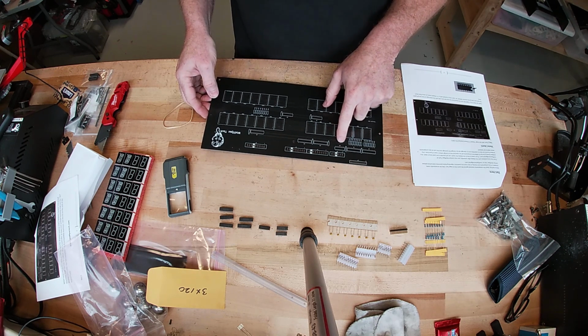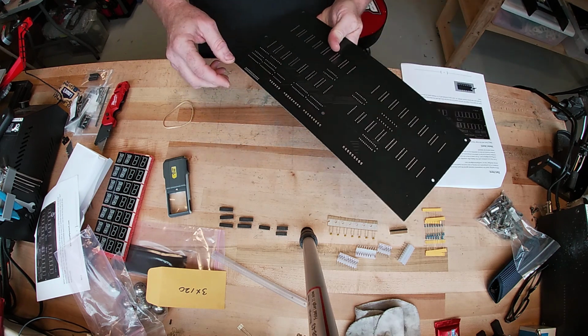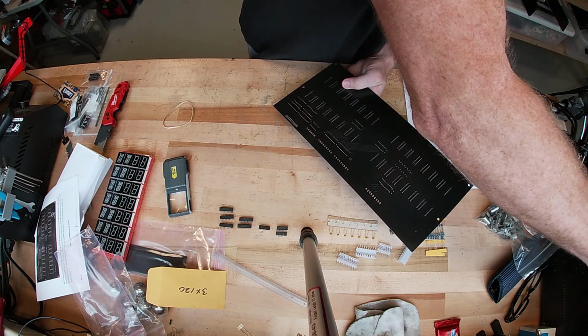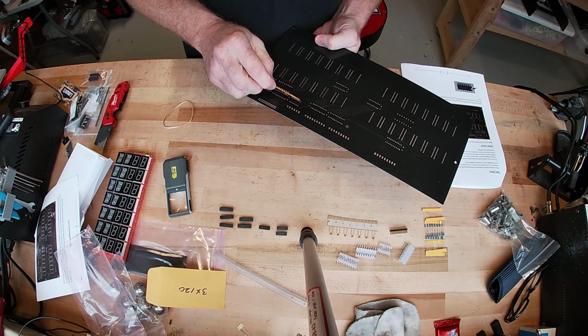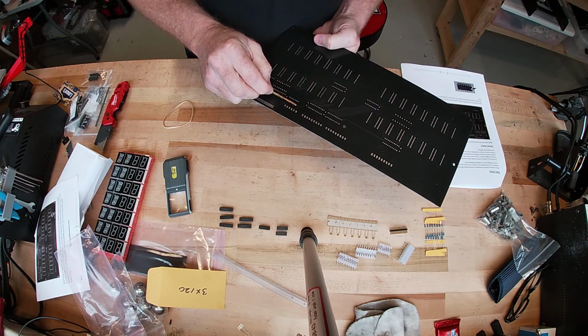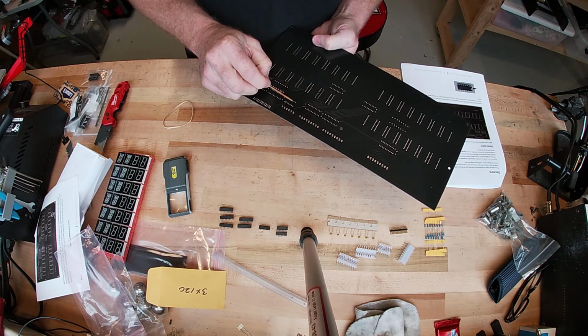and it goes right here, U4. What I normally do, before I put the chip in, is it's a little bit easier to do this before all the legs are sticking out. Just put a little bit of flux all over the little pads, and that'll help the soldering.